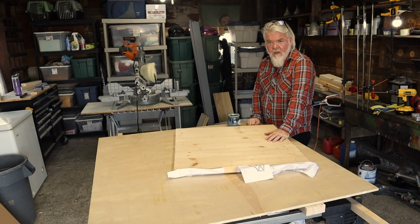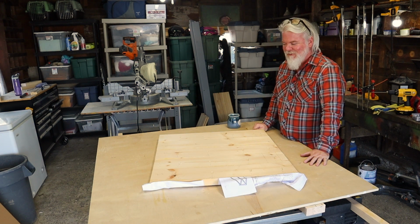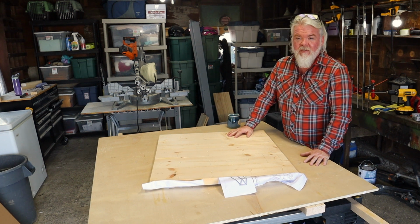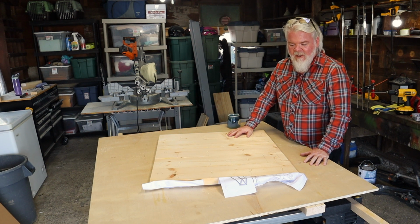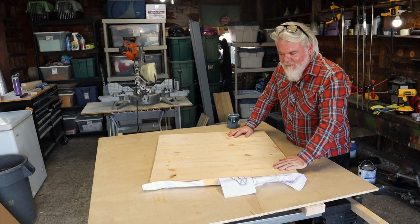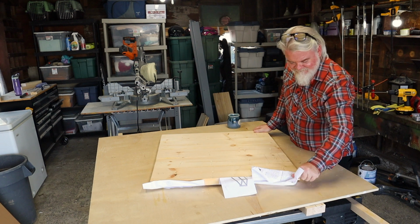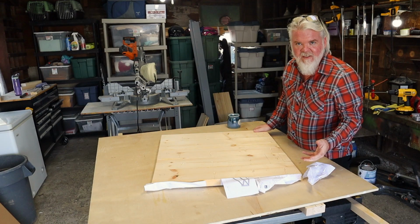The glue up is done of the tabletop for the end table, and that's great. Essentially, when I started off with it, I had the wrong side up on one of the boards so that you can see the pocket holes, and I discovered that after I glued it, so that was a problem. I had to quickly take it apart, which left me with an end that had glue on it. So now I'm thinking, crap, I don't want the wood to be stuck to my clamps. I figured the least offensive would be to grab some paper and use that in between the clamp and the wood. I figure I could just sand it down.